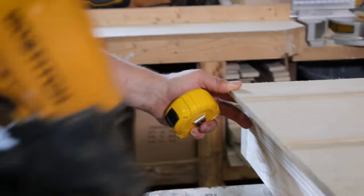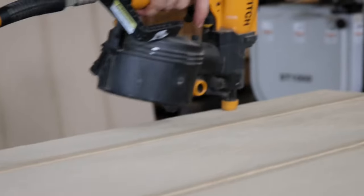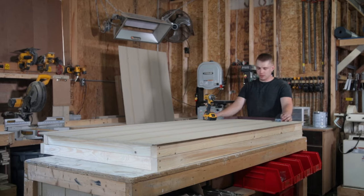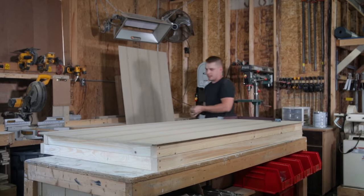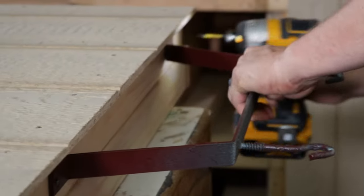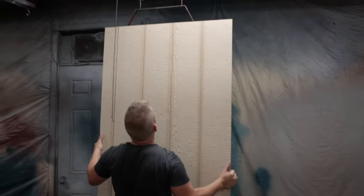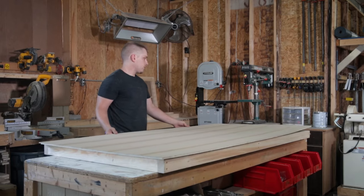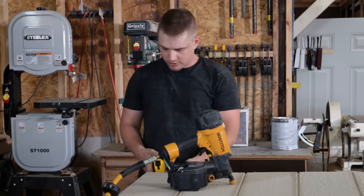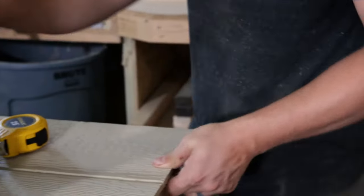I can continue nailing the rest of the panel from here. We got the panel on the right door. I am going to put the hook on the door and take it over to the paint booth. Putting the panel on the left door is the same as putting the panel on the right door, except that we will start on the top left corner this time. We will use our same 7 eighths of an inch measurement on the top and on the side.